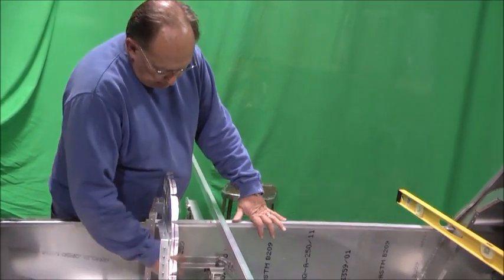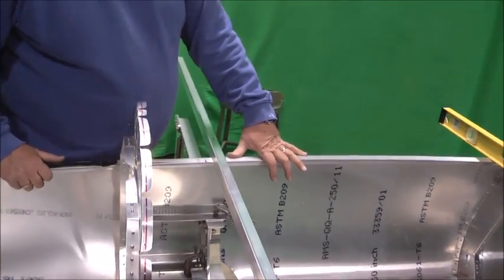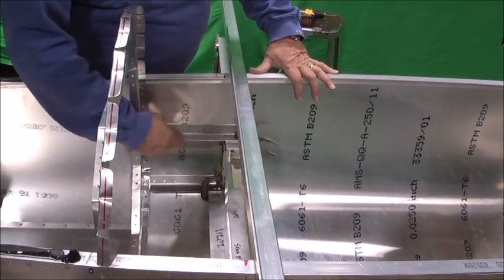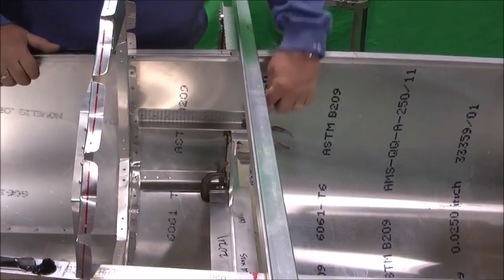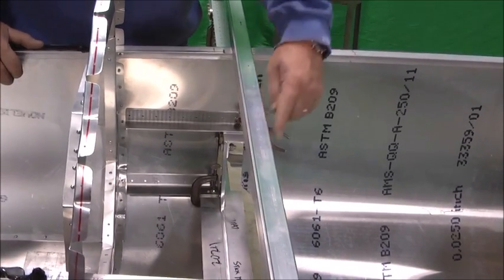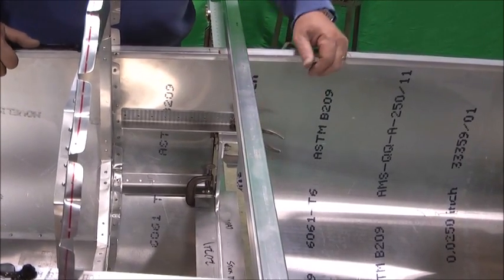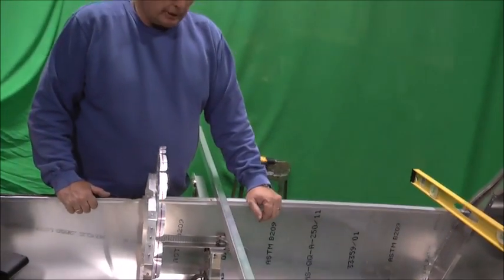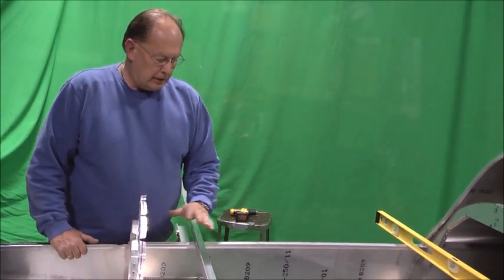Now these are stainless steel rivets. It calls for stainless rivets on your plans and in your kit. Just remember, these are stainless through here to the fuselage. AN 4-6 bolts, 4 of them, 6 of them counting the ones through the bottom, for the hardware. And that'll take care of mounting the spar.